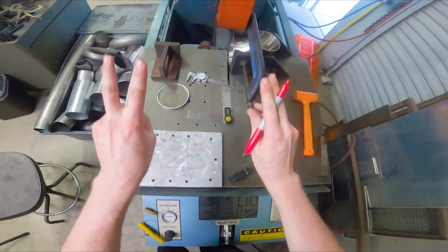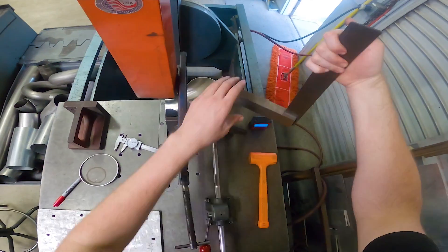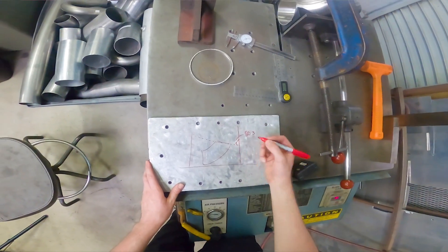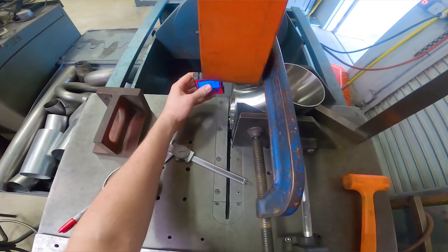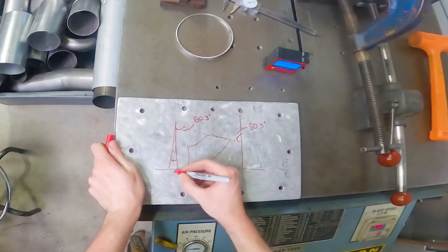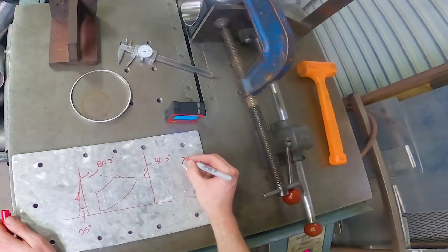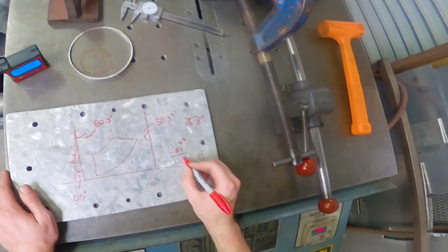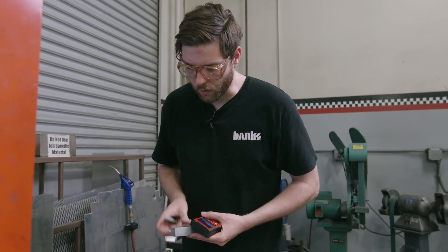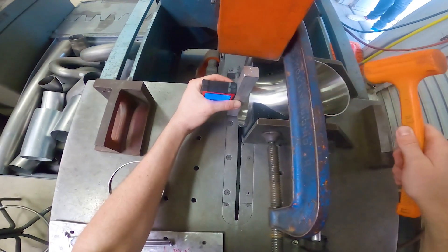What I have drawn here is how I'm going to get this existing piece down to my needed angle of 76.3 degrees. I grab the backside edge using the table as a reference — that's 80.3. On the opposite side, if everything were perfectly square, that would also be 80.3, but it's not. This is a tilt table and I had to tilt the saw to cut the mandrel bend. That 0.5 degree tilt needs to be accounted for. Essentially I'm at 80.3, I need to get to 76.3 — taking off 4 degrees, but my blade is already at 0.5, so I'm actually cutting off 3.5 degrees. I took my angle gauge, zeroed it on my first zero cut, hammered it out until it hit 3.5, and locked it in place. Now I'll run this cut and it should be right at 76.3.